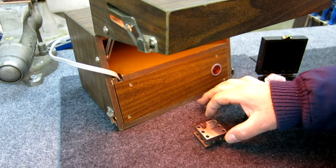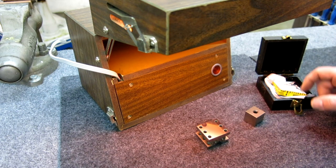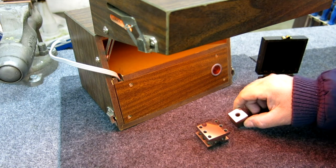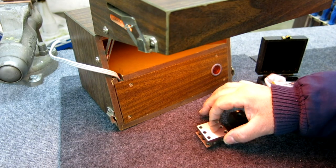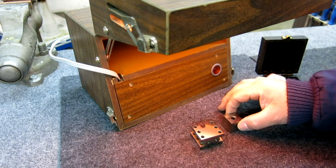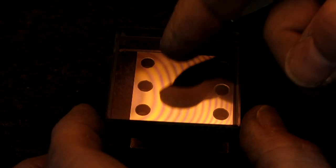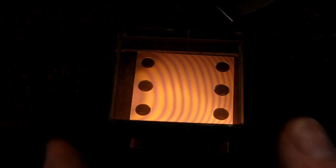We lapped the Anton V-block here on the bottom, and we're going to test it with the optical flat. I also have a Mitutoyo gauge block here as a comparison so you can see what a really good surface looks like. I don't expect this to be as good as that — you'll be able to see the difference. I'm going to reframe the shot to make sure I can see the interference bands. It's a little bit of a trick to get the flat on there without getting anything underneath it.